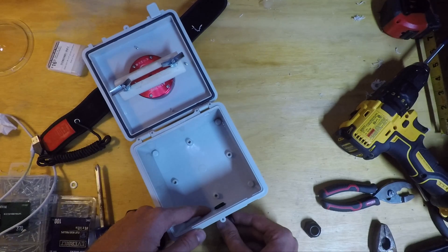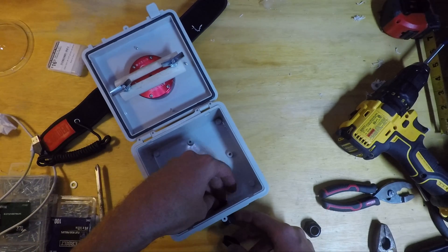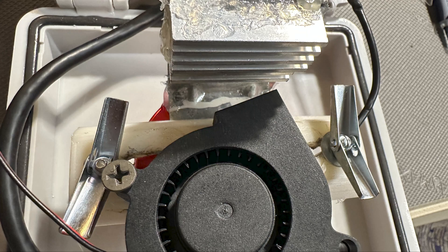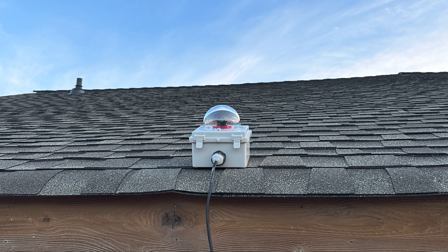I pretty much was winging it the entire time, with no plan other than the concept in my head. After a first initial test run, my camera ended up hitting about 160 degrees Fahrenheit, or about 70 degrees Celsius. So then I installed an L-bracket with some radiator fins and thermal paste to the bottom of the camera, with a small fan blowing across it to help with cooling. It actually works pretty well — it lowered the camera temperature by about 20 degrees Fahrenheit when the sun was at its midday peak. The roof is already pretty hot, but thankfully this is only really an issue during the summer months.